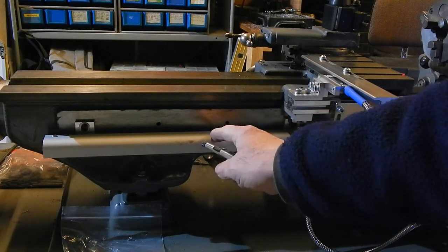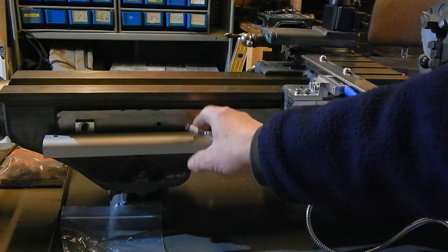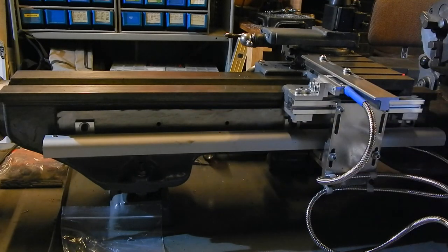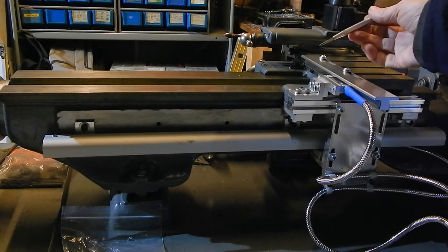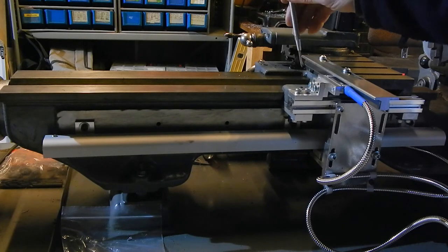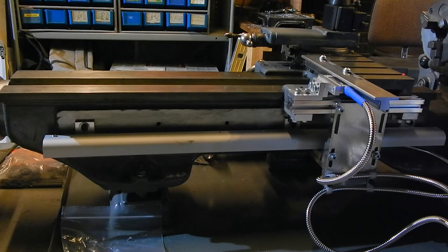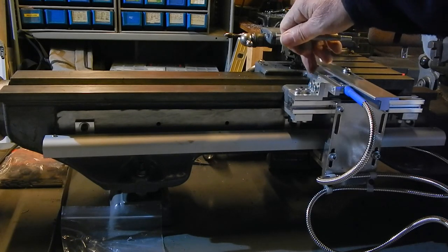This sensor is very well protected. It has a stainless steel cover plate and also this aluminium moulding here, which should protect it against the swarf. The cross slide sensor here is not quite so well protected. The magnetic strip is down here underneath this stainless steel cover strip — but that's all the protection there is, so I imagine you'd need to be quite careful when machining cast iron that the dust doesn't stick to this magnetic strip.